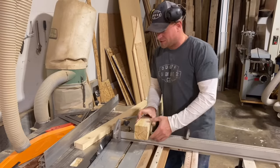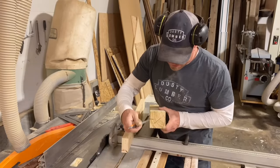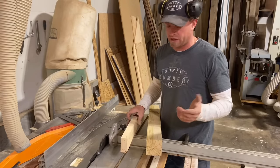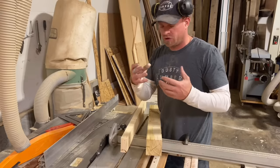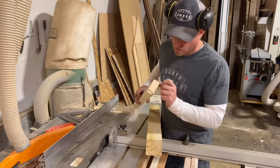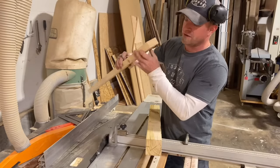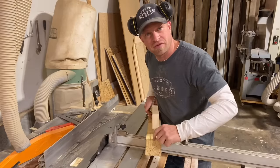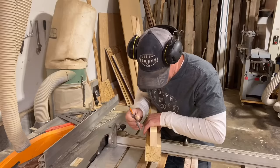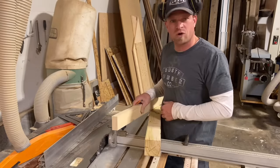For these castle joint things, we're working with two pieces of wood. We want four pieces on the outside and a half lap joint on the inside. With woodworking you can do a lot of math, but I just use the wood and trace stuff out. I found the center of each piece of wood, laid the two centers right on top of each other, and traced out the edge of the board to know where my saw is.